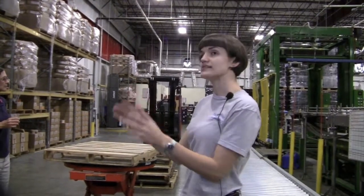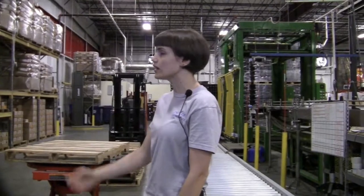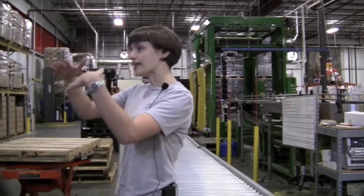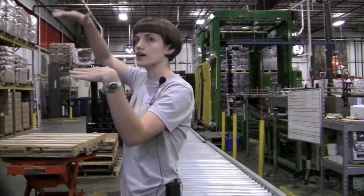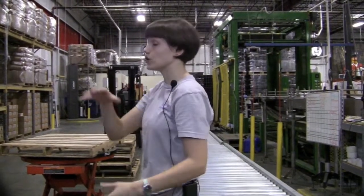So we're done with the fermenting. We drop the beer to freezing, which is about 28 degrees for beer. It's got that alcohol in it, so you need to get it a little bit colder. And at that point, the yeast and the beer separate like oil and vinegar. We can pull that yeast straight off the bottom with those cones,